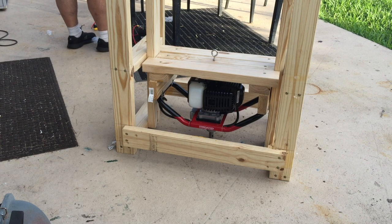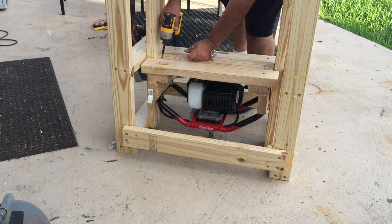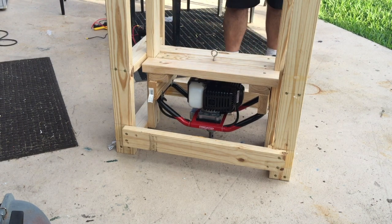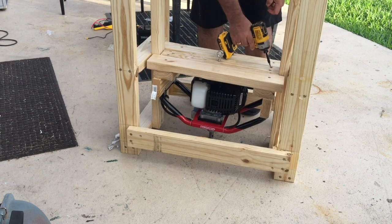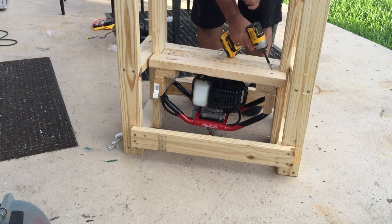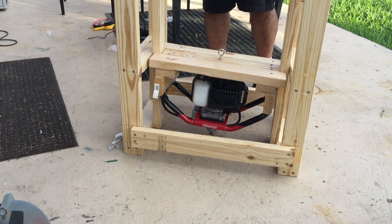The whole purpose for the tower was to take the majority of work out of digging post holes while not breaking the bank. Anyone who's ever used an auger to dig a hole appreciates the work saved — digging a hole by hand is back-breaking work. However, using an auger is still considerable work. When an auger digs a 36-inch deep hole for you, you still have to lift 60 pounds of auger and dirt up, and not just once — up and down constantly. If you're dealing with sandy soil and roots, there's the added bonus that you still have to dig by hand the sand that's fallen back in the hole.